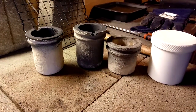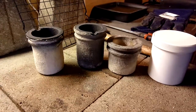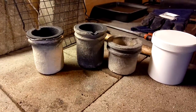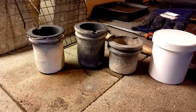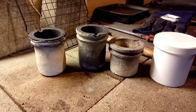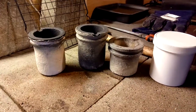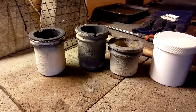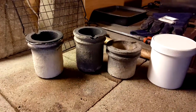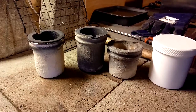I got online and looked on YouTube about extending the life of crucibles. There was one guy on there — I don't remember his name, an older fella — he was making smaller crucibles but was using a ceramic coating on them. He had a mixture of two different ceramic coatings he was putting together and he was extending the life of his crucibles.